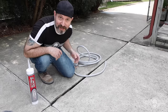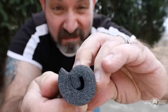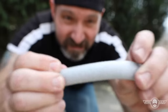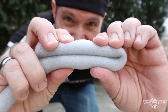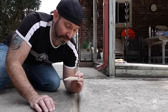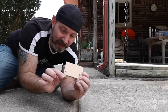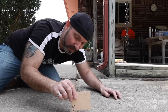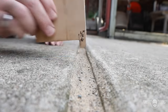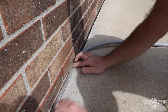For joints that are one inch or more, another great tip: use pipe insulation. It has a C-shaped design where you can curl it inside itself and make it virtually any size you want. You can double up on three-quarter inch backer rod, but I find that to be quite the pain. To know the backer rod is a half inch below the surface, I made a simple tool from quarter-inch Luan plywood with a half-inch notch cut at the end. I just scrape the excess sand away and use it to push the backer rod down to the correct depth, then brush the excess away.